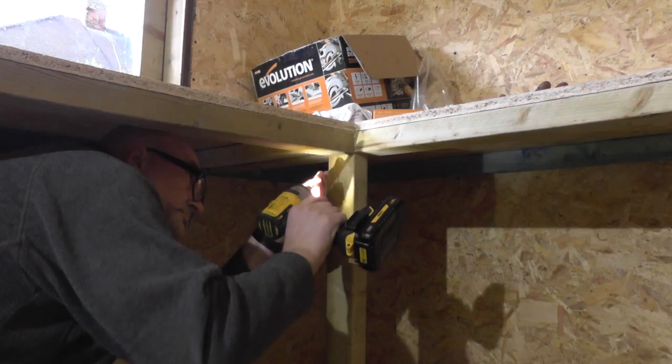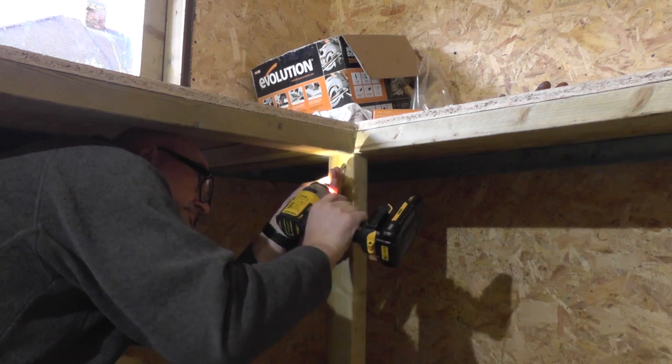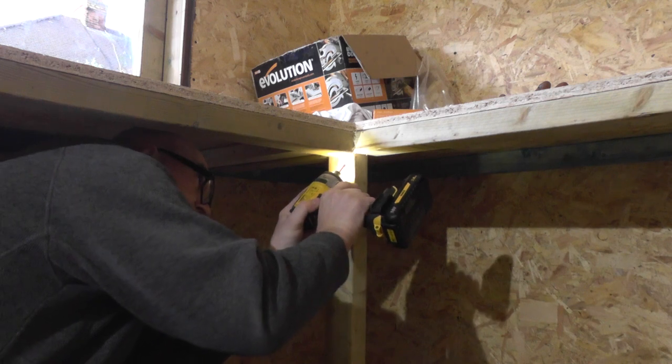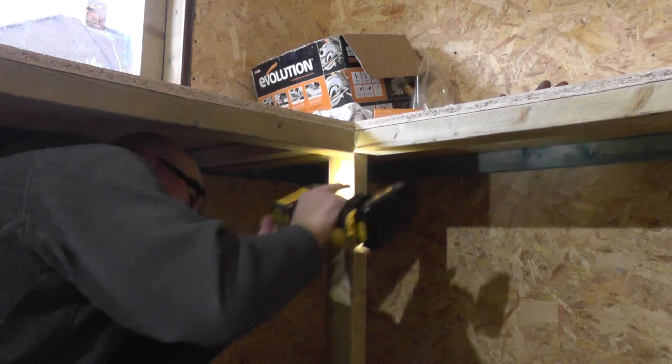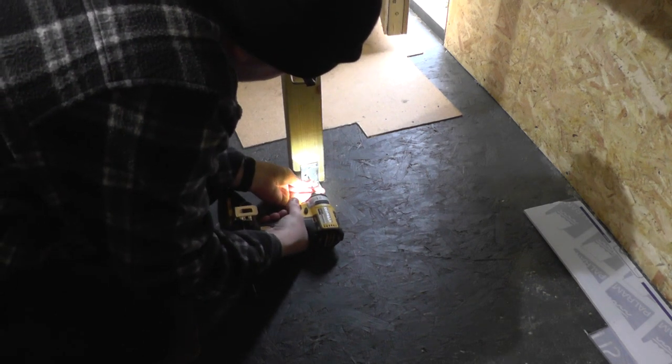So as you can see, there's no fancy joints or anything on here. I'm not a qualified joiner. Everything is fixed mechanically, and the butt joints. So just to make sure that these legs are as secure as possible, and also keep the worktop stable, I'm just using these angle brackets and securing the legs to the floor, just to keep them nice and upright and stable.